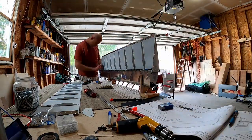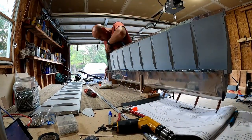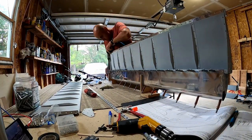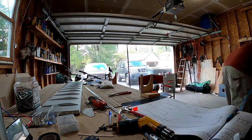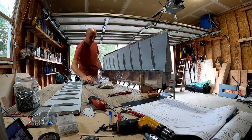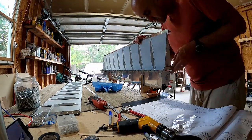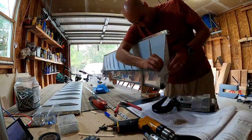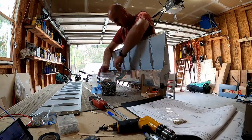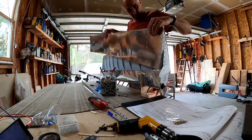Now these were tough. These are 470-4-4 universal head rivets. I mushed like one of them over on each side — still structurally sound, just a little bit mushed over because the bar moved. I must have turned the pressure up too high or didn't hold it quite right.